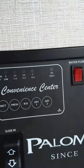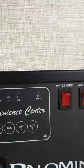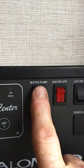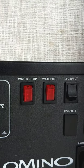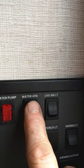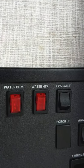I told you about the water pump — you can pump your own water, and you'll also use the water pump to winterize. You turn that on here. You're only going to use this if you're pumping your own water out of your fresh water tank. If you've got city water, it's already pressurized so you don't have to do anything. To light your water heater, you're just going to go like that — it lights automatically.